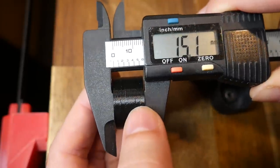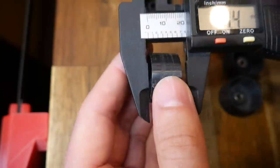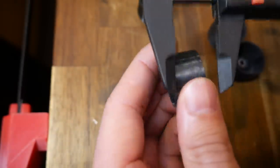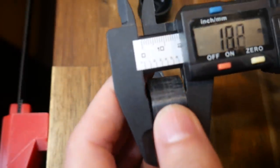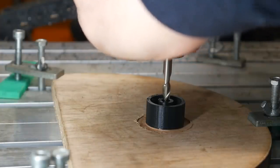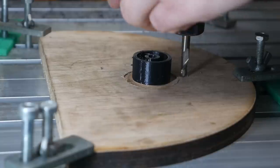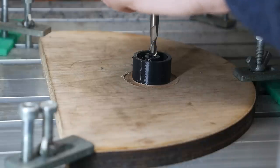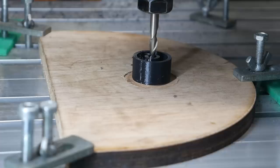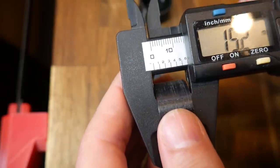Our final dimension is the wheel width — again the minimum is 15mm, so we aim for just above this. The 3D printed wheel was pretty close, but my first three machined wheels were consistent at 15.6mm, which is actually too wide for what we were aiming for. When zeroing the machine, I found it really hard to tell when the cutter had been lowered enough to be touching the right portion of the model. For the final wheel, I zeroed the Z axis on the surface of the timber, moved the end mill into position at 0 X and Y, and then manually moved the Z height to 15.3 before zeroing again. This change in process gave me a much closer final value of 15.2mm.